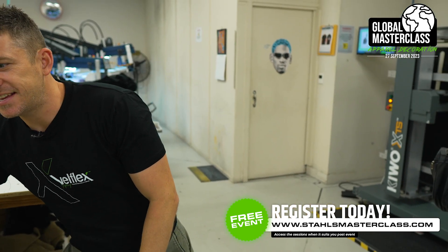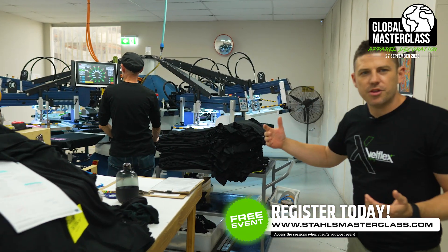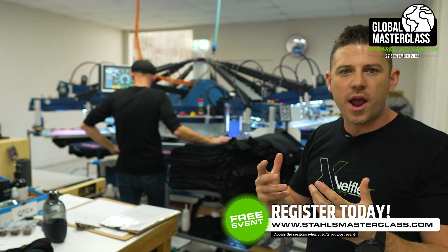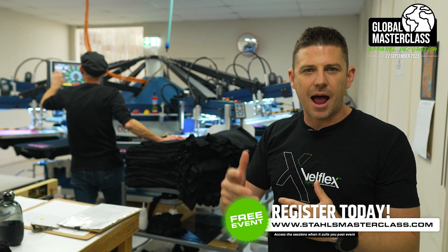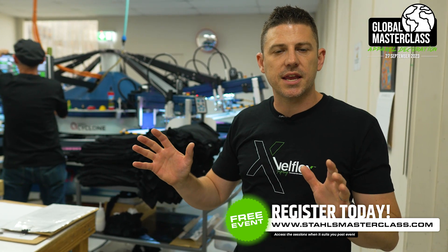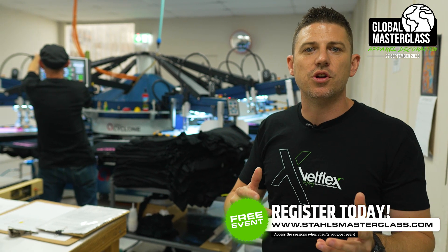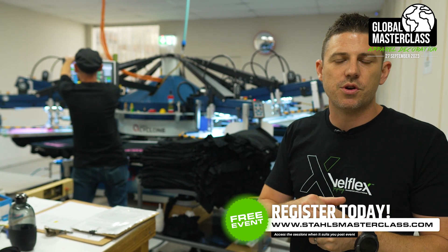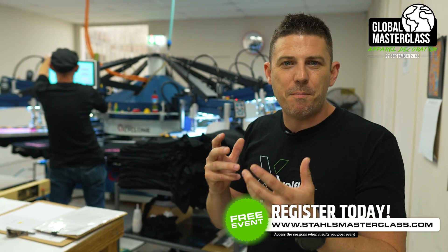Now, obviously you can see here we've got another dryer. There's another more sophisticated screen printing unit down here, able to do a higher number of colors. So you can see the number of actual screen units on there. Why is screen printing good, and what type of job is it good for? It's good for those T-shirt runs, the traditional sort of garments like cotton tops. It's where you want fewer colors but higher volume runs. You don't want to be screen printing ones, twos, or five units, or even 10 units. There's quite a lot of setup that goes into a screen printed job. So it's designed for those higher volume runs. To keep your costs down, one color or two color jobs via screen print — that's where the screen print process is best suited.